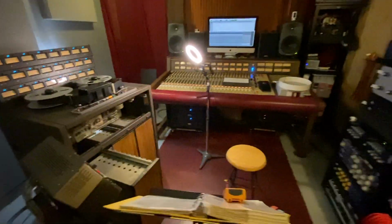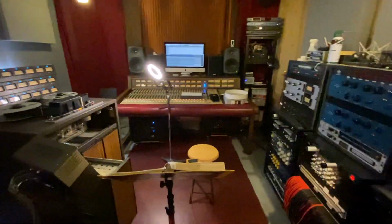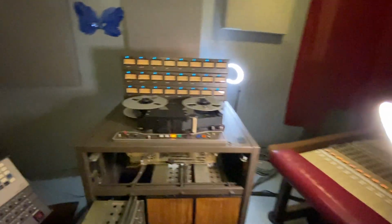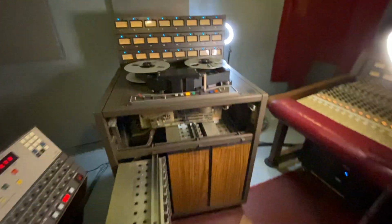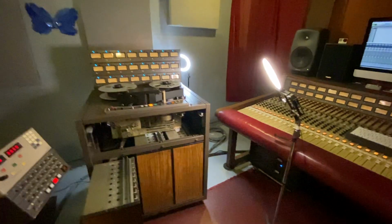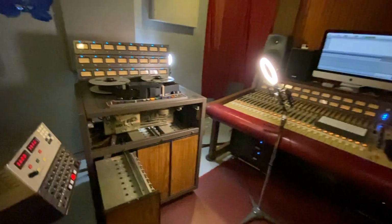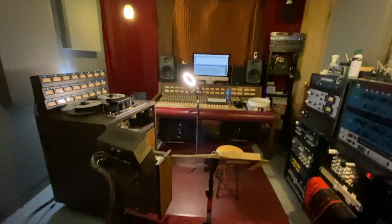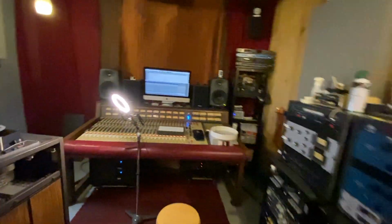And I'm going through a full calibration right now because I have 2 bands lined up coming in, and I prefer to hit tape for drums, bass, and rhythm guitars. Other than that, I still got a lot of channels to go through. I have the test tone tape on here, and I'm going to go through the full calibration in both 15 IPS and 30 IPS, although I think for one of the bands, I'm going to definitely record at 15 IPS because we're doing more songs. And to me, tape time is more important than going 30 IPS and getting that little bit of high end that I get back from Pro Tools anyway.